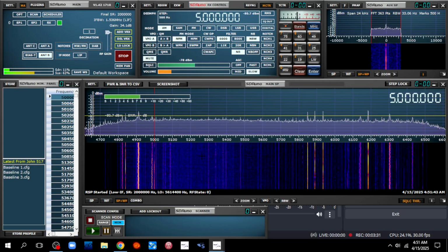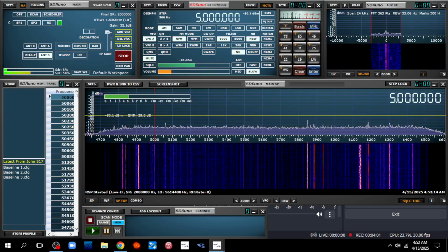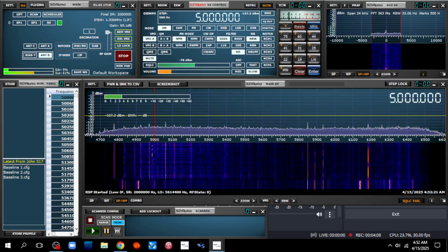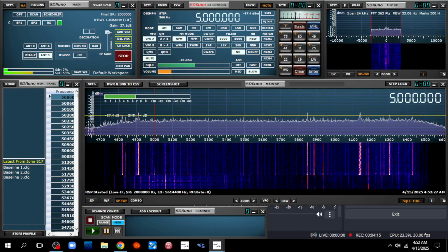So, like I said, I'm on the little tabletop loop antenna. I can reach it now, so I can rotate it. I'm rotating it, and you don't see much difference, so it does not appear to be directional. Now, it has an amplifier in the base of it. I'm going to turn that off, and we'll see the effects. There's the effects, with the amplifier off. There are no adjustments, it's just on or off. There's back on. So that's that antenna at this frequency. You'll see different results at different frequencies and different antennas.